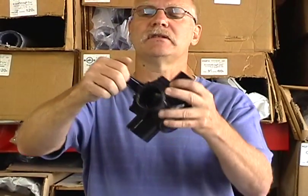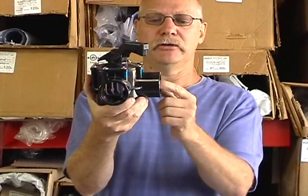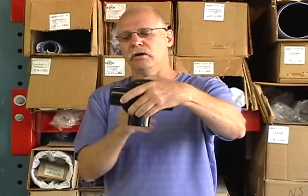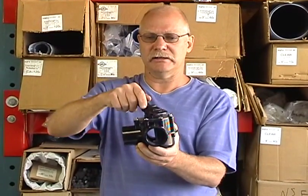What's really cool about this valve is there's a latch with a little handle that lifts up. There are little grooves around the outside, so you can set it — it snaps in place. Right now, the way this valve is situated, I've got flow coming in here with about two-thirds going out this way and one-third coming towards me. You can set it so 20% goes this way and 80% the other way. There's no metering — you have to estimate it or use flow metering devices. But the latch holds it in place; the water won't turn it.